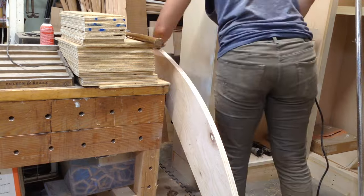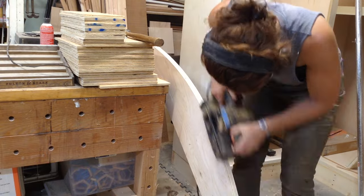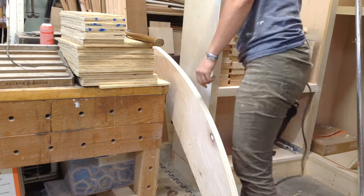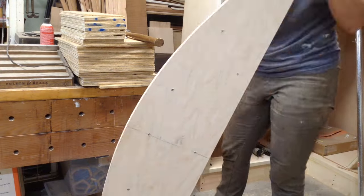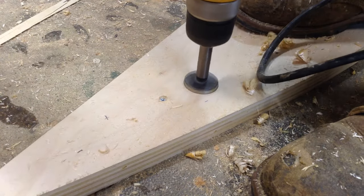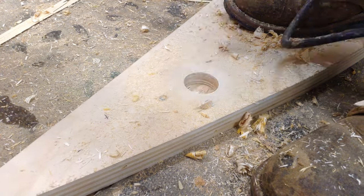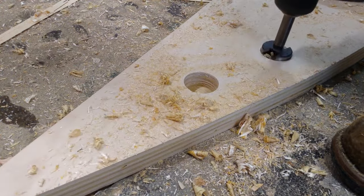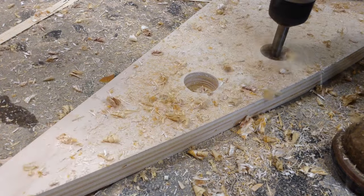I used just a piece of metal for the arch. What I wanted to do was pre-bend a smaller piece of mahogany to see if I could even get it to work, and then do a bigger piece. I'm making this form out of two pieces of half-inch ply, so that if it works, I could break it apart and make a more traditional style form.